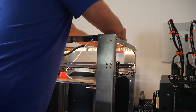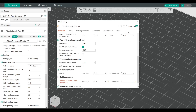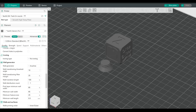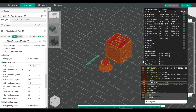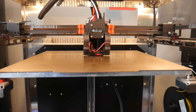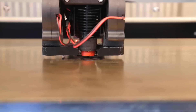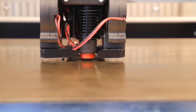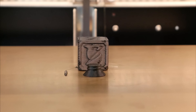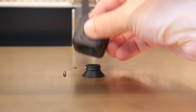To print PHA, I went back into Orca Slicer, opened up my PLA profile, and the only change I made was setting the bed temperature to zero. I print PLA at 220°C on this machine, so I maintained that, hit slice, and sent it to the printer. This printer uses a smooth PEI sticker sheet, and I chose not to apply any glue stick. The first layer was sticking just fine. Half an hour later, the Orca Cube had completed without being knocked off, and I was able to pull off the two pieces by simply yanking them, rather than flexing the spring steel sheet.